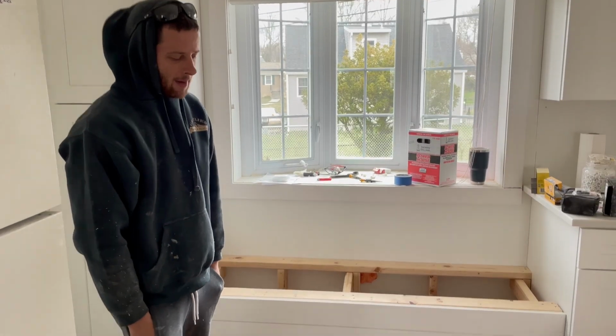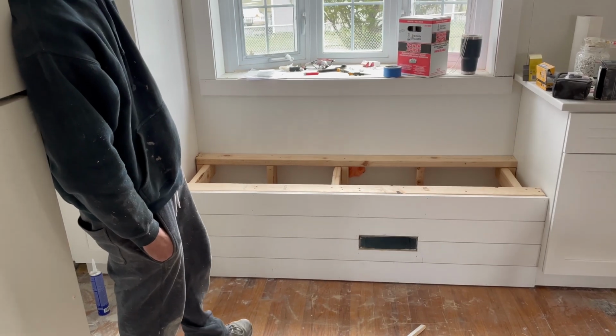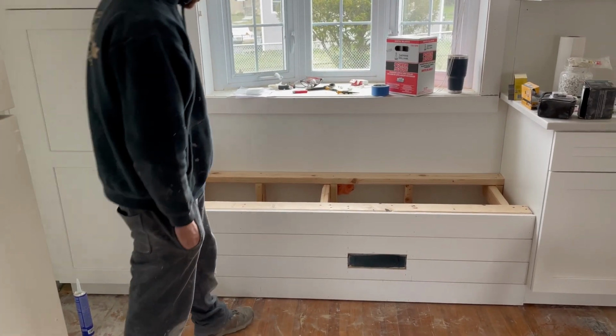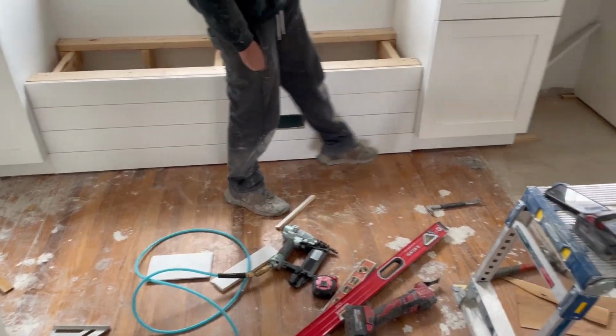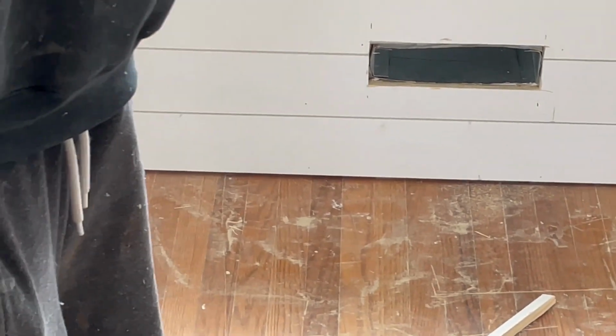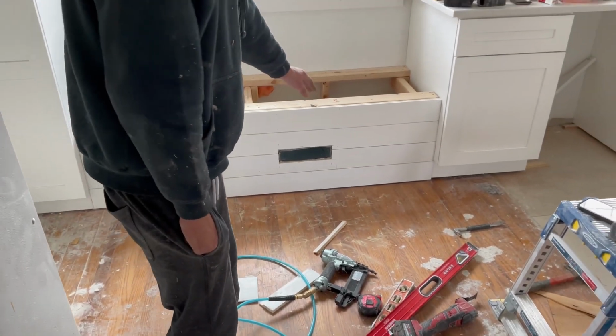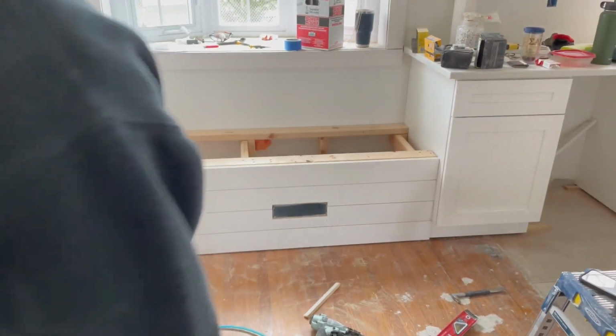All right, we're done shiplap, nickel gapping. It's not shiplap. Oh, that's fake news. Yeah. So what I did was I held it up a little bit since we're going to be meeting our toe kick. What's nice is with the vinyl floor, my floor guy will be able to put the vinyl underneath the cabinets, and I won't have to run a piece of cord around it all. Famous last words. But we're all good to go.